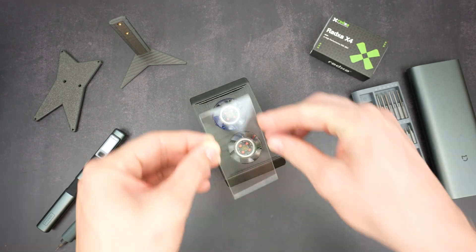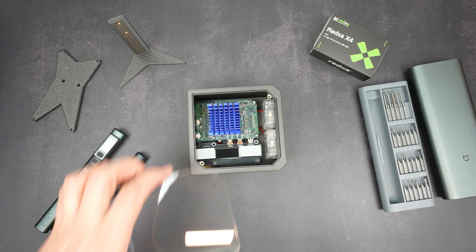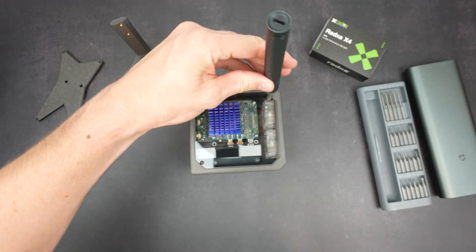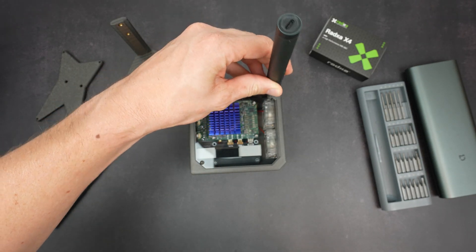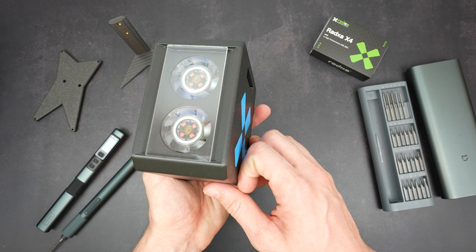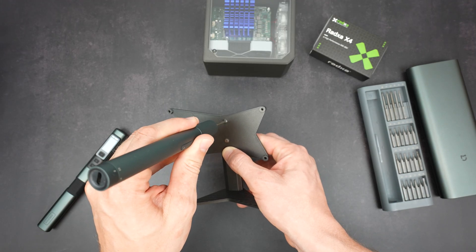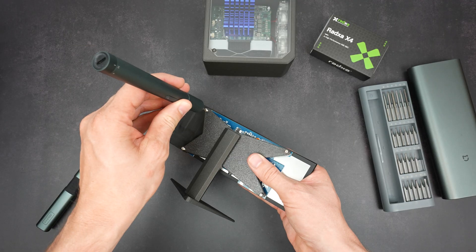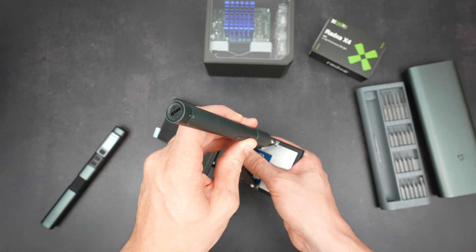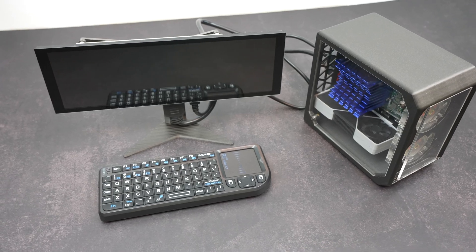The front panel is glued into place with superglue, and the side panel is held in place with two M3×8mm button head screws. That's the case complete. The display holder attaches to the monitor stand with two M3×8mm button head screws, and screws onto the back of the display with four M2.5×12mm button head screws. We just need to add a USB cable for power, an HDMI cable, and the mini keyboard and mouse to finish it off.